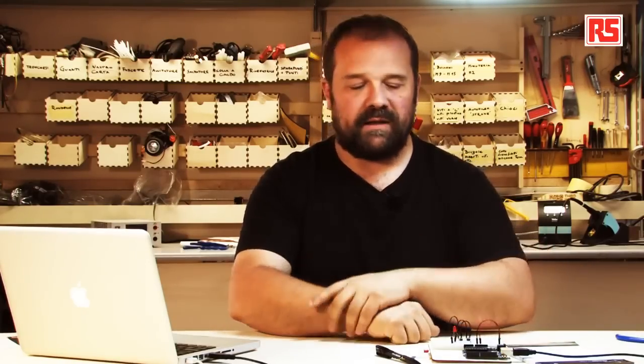This small circuit is creating a very basic logic circuit. The series configuration has AND logic — you need to press one button and the other in order to light up the LED. The parallel configuration is an OR circuit — you press one button or the other. That's all for today. I hope you enjoyed the tutorial. Build it, hack it, share it — because Arduino is you.